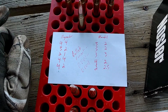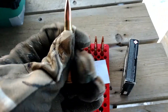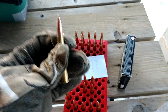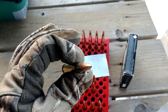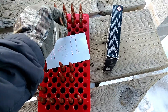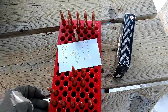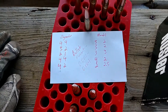My process for these is I'm using a body die first and then a bushing die to resize the necks. Then with the mandrel, I'm using a mandrel to open up the necks, as opposed to the expander ball where I'm just using the expander ball.